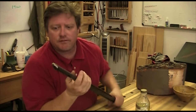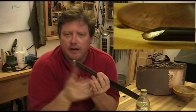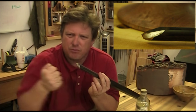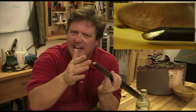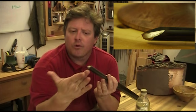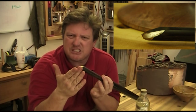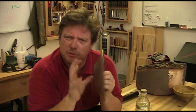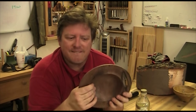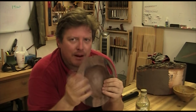That's the problem I've been having for the past three or four years. One accommodation I've made is on my bowl gouge - whenever I grind the bevel, I round off the back side of it, and that's hopefully preventing me from really leveraging that cutting edge. When I'm using the bowl gouge I'm really not pressing very hard; I'm finding this balance point where the cutting edge is pushing the blade into the wood and the bevel is pushing back. When you get a little too aggressive, the bevel just pushes itself and crushes the fibers. The crushed fibers are invisible - you'll sand it dead smooth and won't see them. This piece is a bit punky and softer than most walnut, so I have a feeling the bruising is going to pop out when I put the oil to it.